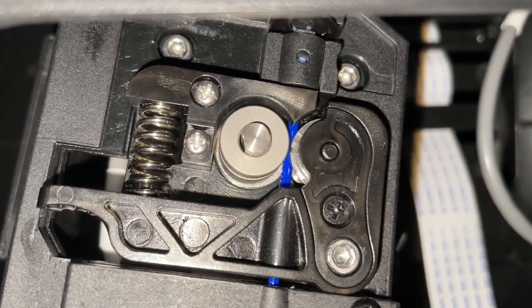The one that was primed at 40 millimeters per second — I noticed that my extruder was clicking a lot. During priming you hear a click-click from the extruder. This could be the gear slipping on the filament trying to push it in, or internally the stepper motor is clicking itself because it's not able to rotate its own shaft. Those are the two things to look for if your extruder is clicking.